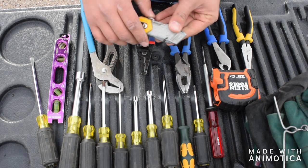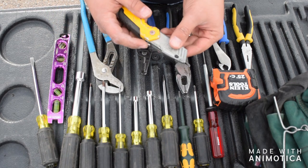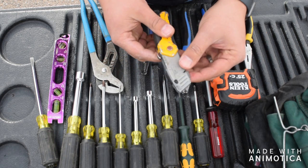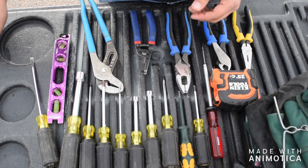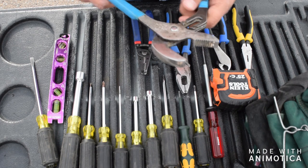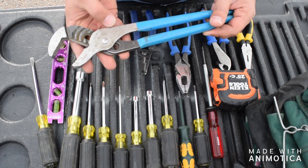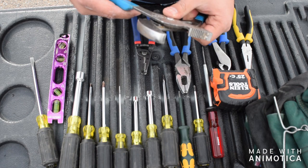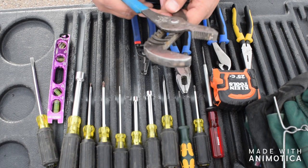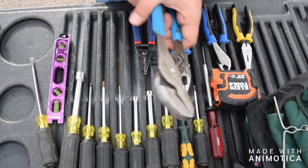Next is a razor blade universal tool that you're going to use on a day-to-day basis. This one's a foldable one I keep in my bag — I've had it for my entire career. These are called channel locks — you should have two of them. These particular ones are the Channel Lock brand 440s. It's pretty universal, can do up to about an inch and a quarter. For a first year apprentice, the Channel Lock 440 is the size you'll be needing.